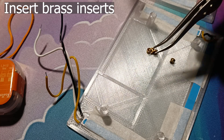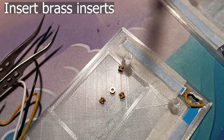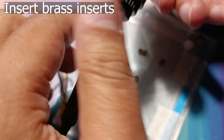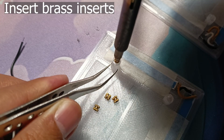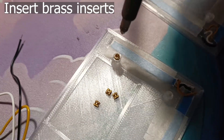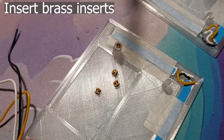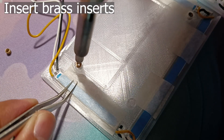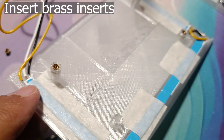Next is putting the brass inserts into the bottom case. This is a bit of a challenge because the inserts are very small, and if the bottom case material isn't heat resistant enough, the material can melt and flow into the brass insert. For this build I used PETG material, so it's slightly more heat resistant. Cool the solder iron, then change the tip to the brass insert tip and slowly melt the insert into the hole. Be extra cautious — I'm not sure how to fix it if you mess up. Mine came out slightly crooked but I was still able to screw the top and bottom cases together.